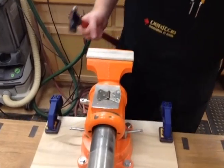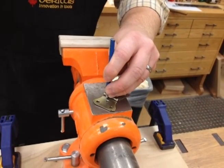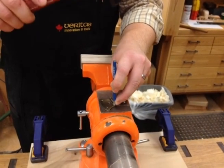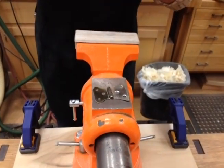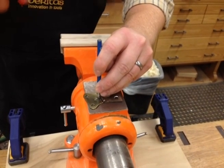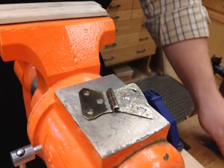To begin this, I'll just set the hinge right on my anvil and work right along that barrel. Starting out, I'm not going to hit it very hard - I just want to see what this does, see what the dents look like, see how close I can get. The other danger right along here just starting out is you can actually get it too straight, if that makes sense. So I actually want to walk this around a little bit so the marks or dents look a little bit random.